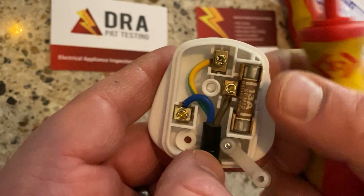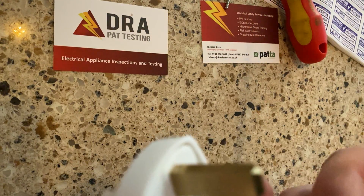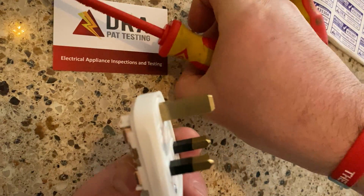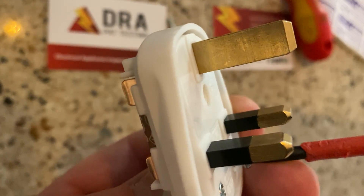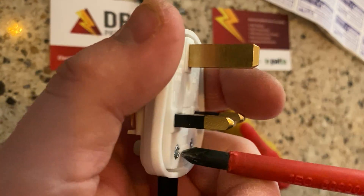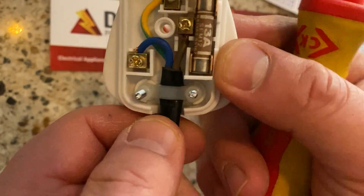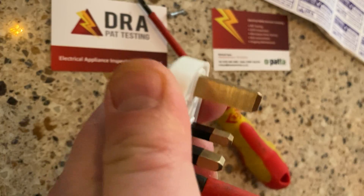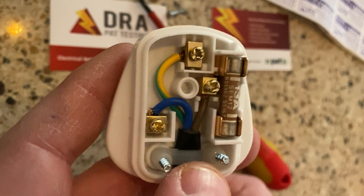By the screw head here, to the cable grip. Push up across, put the screw back in there — make sure you get the right screw. Push that back in there, connect it with the cable grip, then use your screwdriver to tighten it nice and tight. Do the other one so your cable grip is nice and tight, so the cable isn't going to move if anybody tries to unplug it by the lead. The cable grip does its job and keeps that firmly in place. We've got the live in here, neutral to the left, earth at the top.